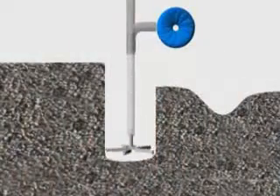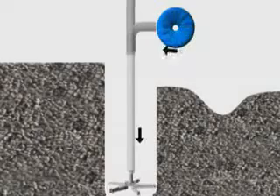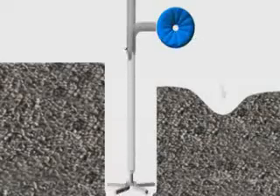The unique direction of the water-based flushing media is profiled. This fluid is sent down the annular space between the drill string and the borehole, removing cuttings back up the drill string and into the settling pit.